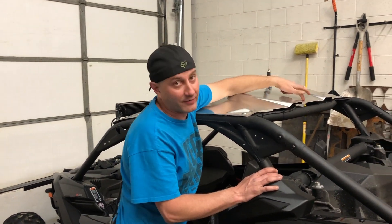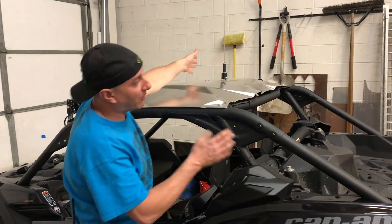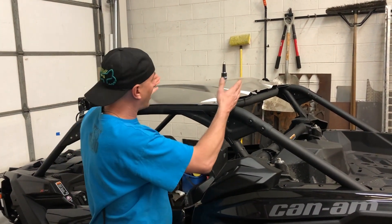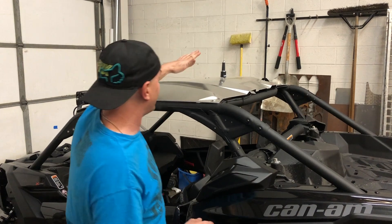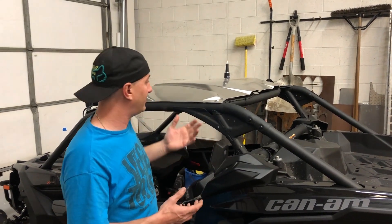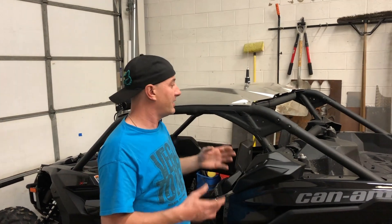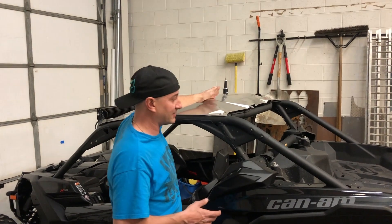You might say why is it so far back — because I don't have 18 inches here. I wanted it there, and it's still got a decent ground plane. You can break the rule, but in general you want 18 inches around it. Now if I didn't have a metal roof — if I had a plastic roof or was mounting it on a tube somewhere — I'd want a no ground plane antenna. But for this application, the standard ground plane antenna is the best.